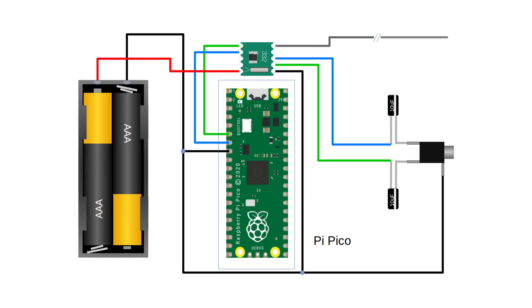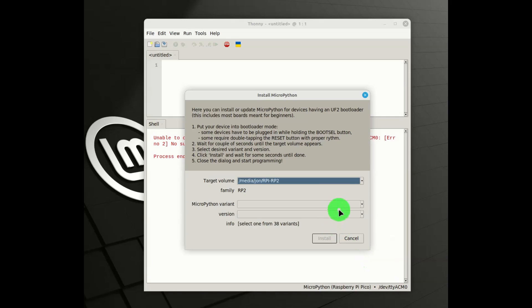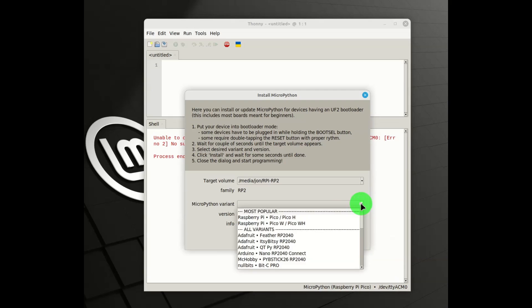The final component is the Pi Pico. The FM radio module is very self-contained — the Pi Pico is just acting as an interface to control the module. We're not pushing the Pi Pico to its limits in this design and performance isn't at all critical. We don't need the speed of C or C++, so it makes sense to use the power and simplicity of MicroPython. To program the radio I'm using Thonny, a very simple Python IDE and a very easy way to program the Pi Pico or other devices using MicroPython.